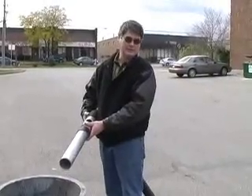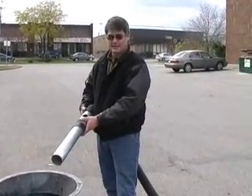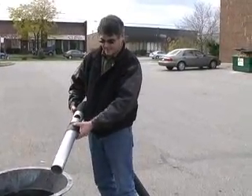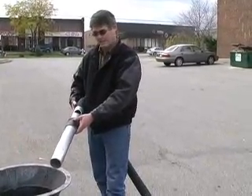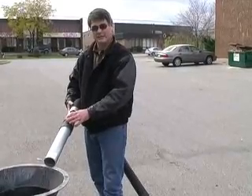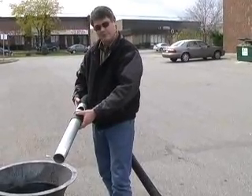We're going to demonstrate that the machine can also be used to pick up golf balls farther beneath the surface, if for some reason you need to do that. What we've done in this case is we've reversed where the hole is and we've put a sliding sleeve on here in order to control the vacuum. The reason for that is we need to be able to plunge the tool below the surface, but we want to keep as much water in the pond rather than in our vacuum, and this is the only way that we can realistically control that. We'll show you now.